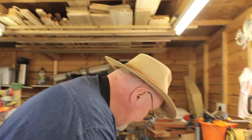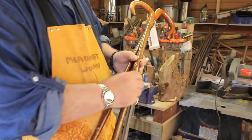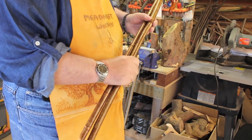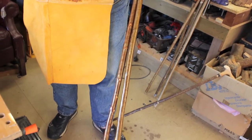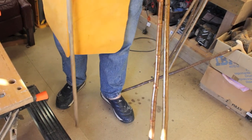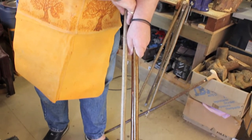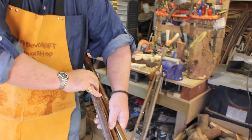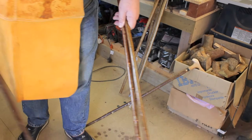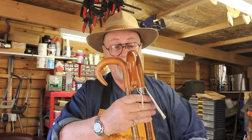Just to show you - this is when it's been oiled. There's only oil there, there's not any dyes or colorations in that - it's just plain boiled linseed oil. As you can see it does change the colour. This one will probably come down to that sort of coloration, and something a bit darker in the hazel will come down more to that colour. So it's really just a question of seeing what's there in the wood.